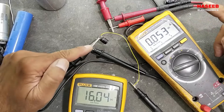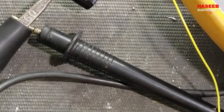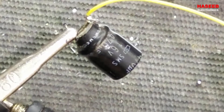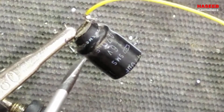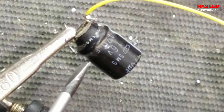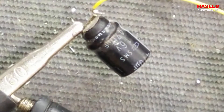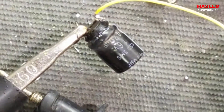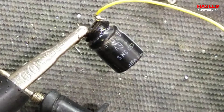The current increased then decreased — the capacitor is near destruction and about to blast. At 50–55 milliampere we can see material coming out from the outer cover. After heating up, pressure built up inside and now the capacitor is damaged. This capacitor was destroyed at exactly 16 volts in reverse polarity, which is its rated voltage.